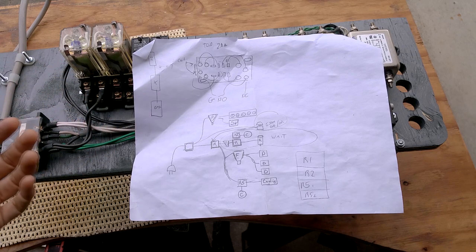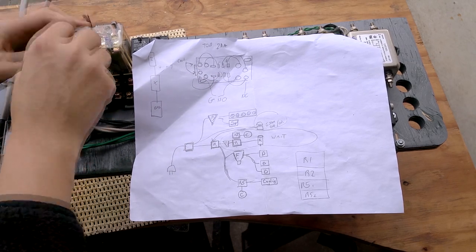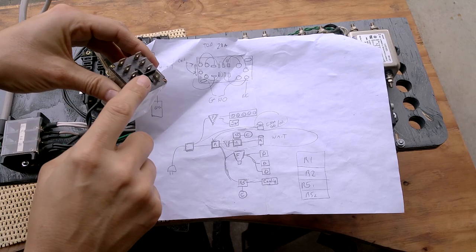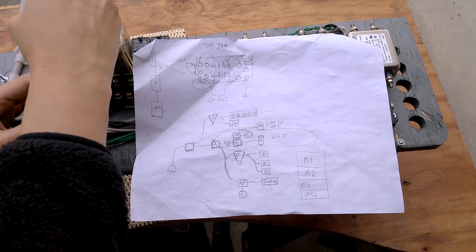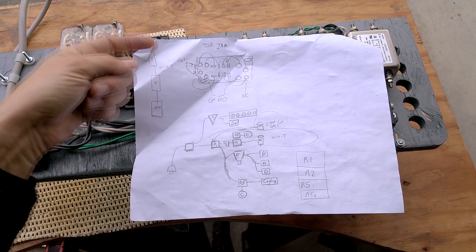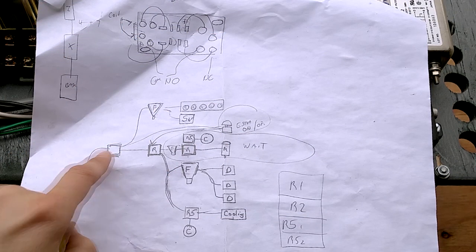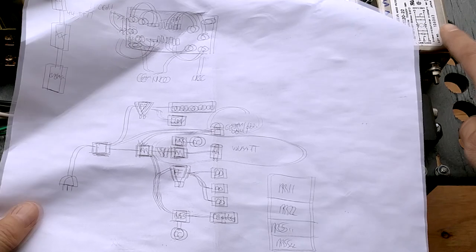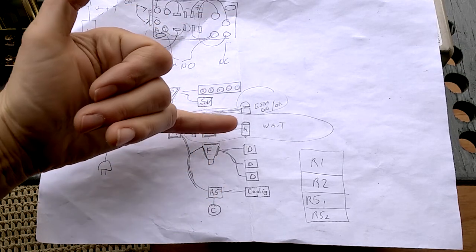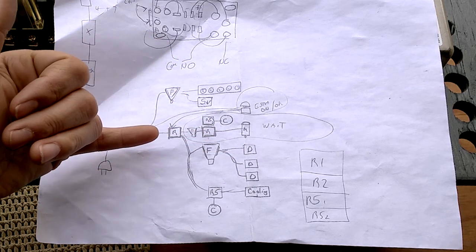Before wiring this board I had to have some idea of what I was making. One of the first things I did was reverse-engineer the relay — I took it out of its socket. There are coil contacts and switching contacts — normally open, normally closed, and common. Then I came up with a plan: I've got an AC line cord, a terminal block, common-mode chokes shown as filter symbols, the outlet strip on one circuit, and the drivers on the second circuit with another filter.